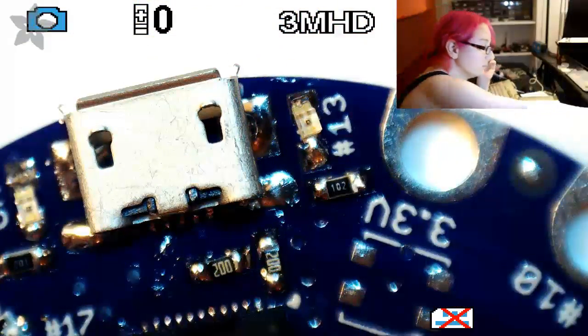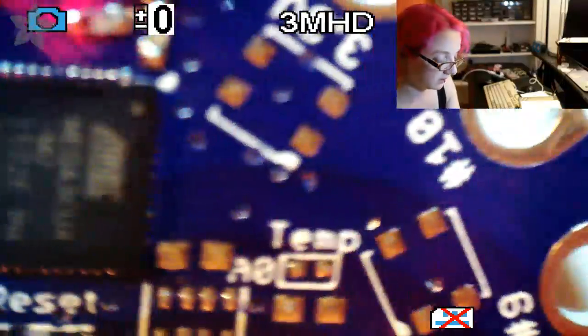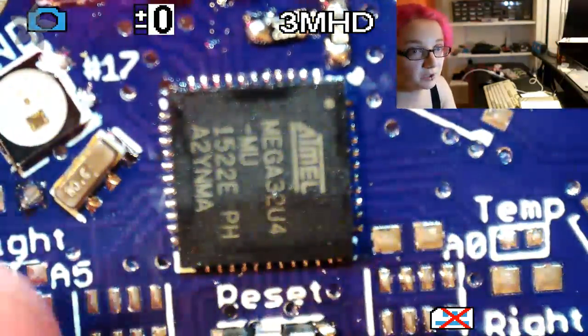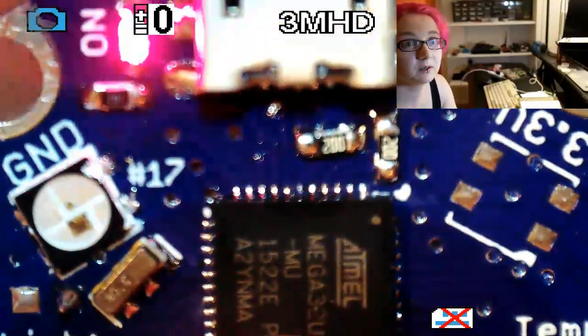Yeah, I can try plugging it in, seeing what happens. I don't have capacitors on it, but let's see if maybe the power LED turns on. Ooh, I heard from my computer that it enumerated. The power LED is on, and my computer bleeped, which says it found the device. So having found the device means the micro USB is good, the 2 resistors are good, this chip's good, the crystal's good. If I press the reset button, I can turn it on and off.